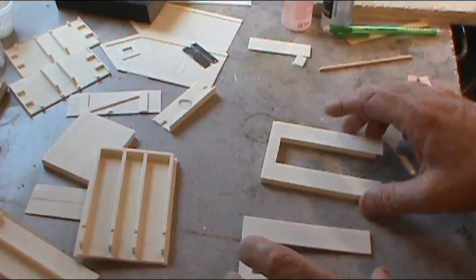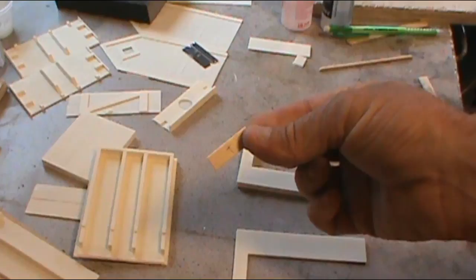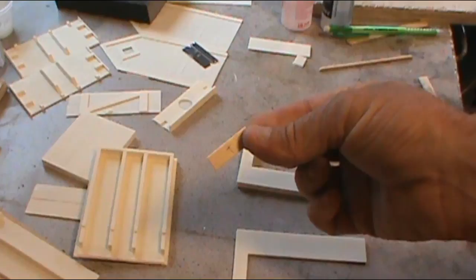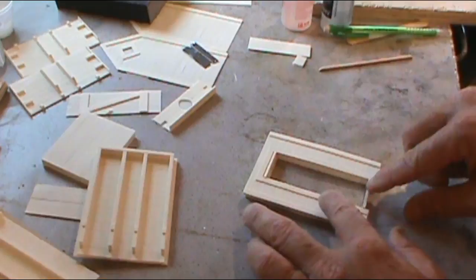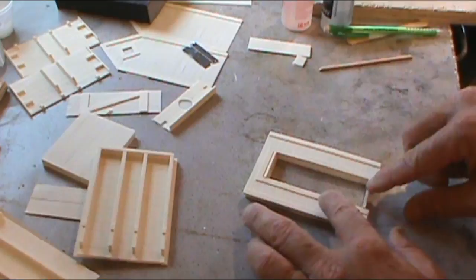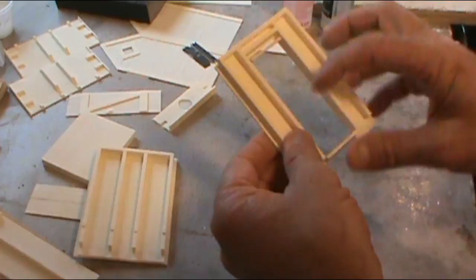One thing about the door — I'm showing you this because we need to make sure the width of the door top and bottom stays the same. I made two pieces from popsicle sticks that fit inside the door opening. So once we put our skin on, we can stick this in and it allows the door to keep the space correctly at the bottom. On the outside, make sure the top edges are in the middle and that the door doesn't get pinched in when it's done.